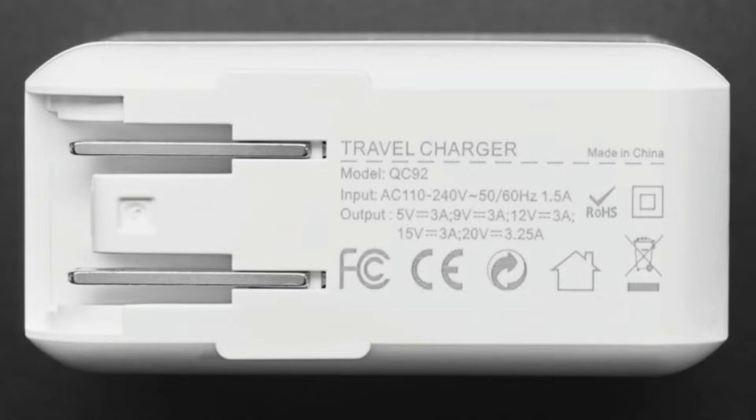Now we have USB PD, which is power delivery over USB-C, and usually you have an adapter that looks something like this. This is like a laptop or iPad charger. It's a generic USB-C adapter, and you can see the output. It can give you 5, 9, 12, 15, or 20 volts. I do have to specify it's or. You only get one voltage out, but you can choose from any of these.